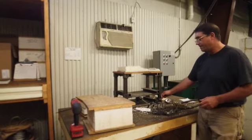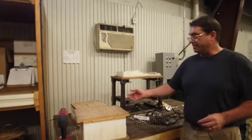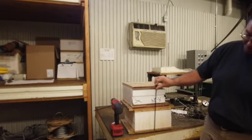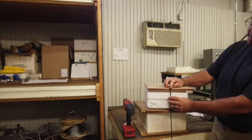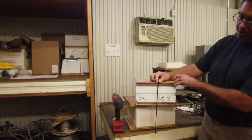So the length of the shaft is really just going through foam, right? It's just going through foam, yeah. So if this were, well, this might actually work. If this was a full panel, now it's a little short, but realistically all it does is go through, and having the larger pancake head keeps it from penetrating or ripping through the OSB.